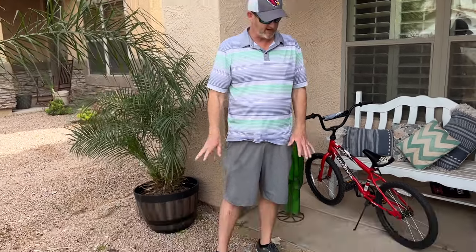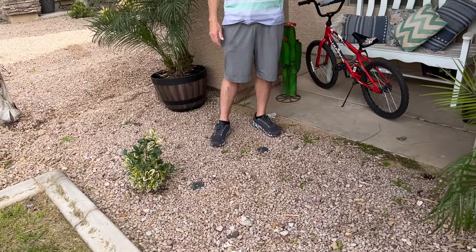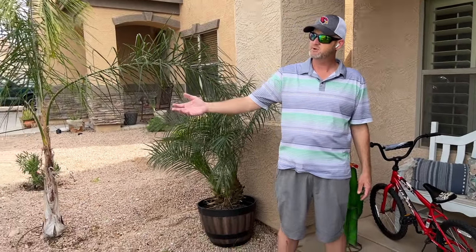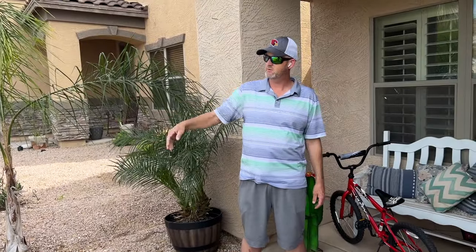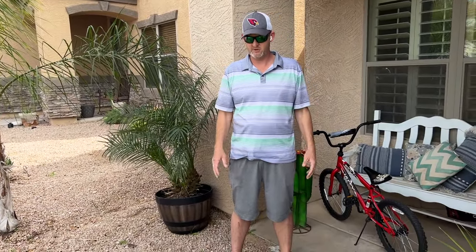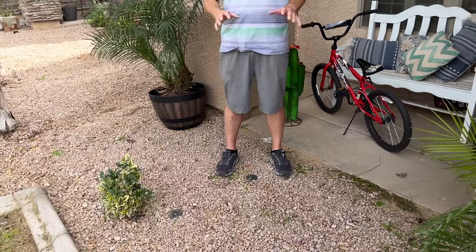What do you do when you can't find these? Old houses are often covered in landscape. Maybe it's on the side of your house — I do not recommend going inside your house, you can flood it. At that point, you have to figure out what your city regulations are. Can you run it to the street? Can you run it into your yard and do it slowly? A lot of times we'll just run it to the street and run it overnight, but some cities will fine you if you don't go into your sewer caps. You may have to dig them up and find them.